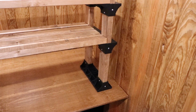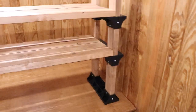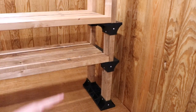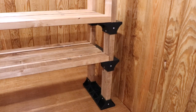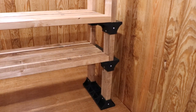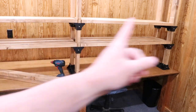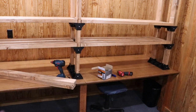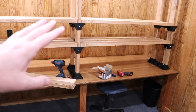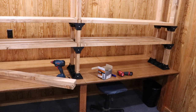I'm putting it together here at the front, then I'll push this all the way to the back. As you can see, I've just got some 2x4s going straight up and down as studs to hold the suspension here, and then across here I've got four 2x4s. Believe it or not it's a pretty heavy setup, but if you don't span too much space between each set of legs you will have no sag whatsoever — and I'm putting heavy equipment on this.